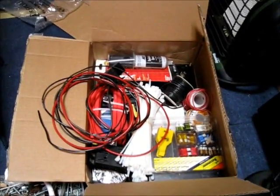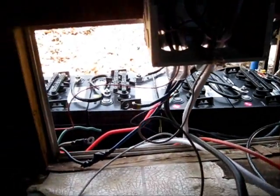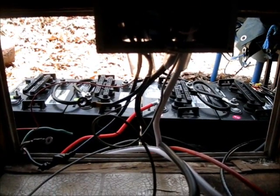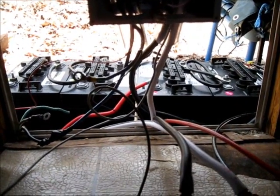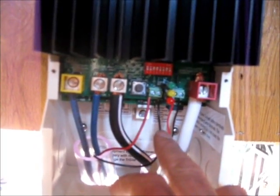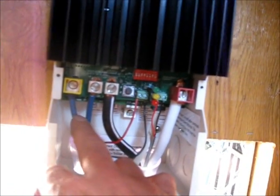This is our construction zone again. I'm over to using the stuff Dave gave me, using the wires. I've got my TriStar ripped apart. I've finally opened it up and put in the temperature sensor gauge and also my battery voltage sense wires, which I'm now hooking up. I've also put a bigger wire into the solar panels, so I've got fatter wire coming from the solar panels into the charge controller.